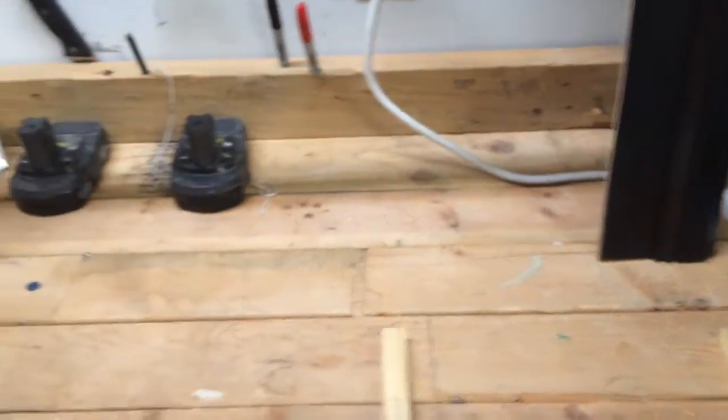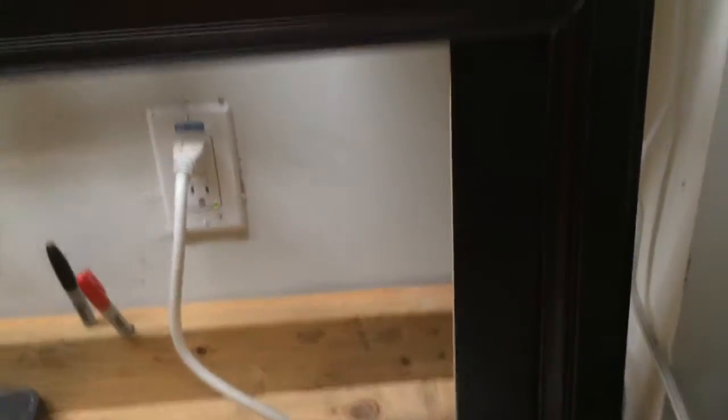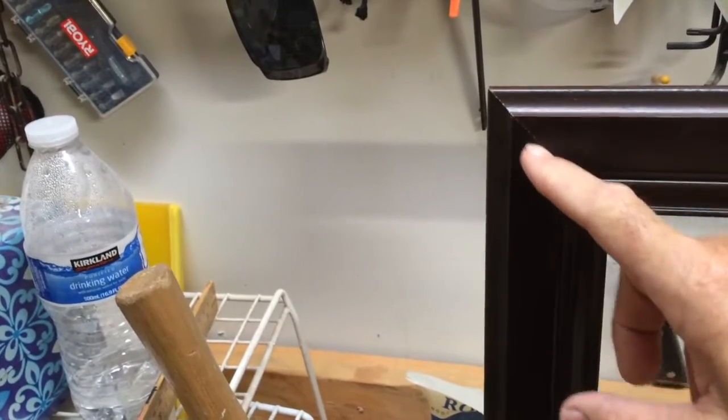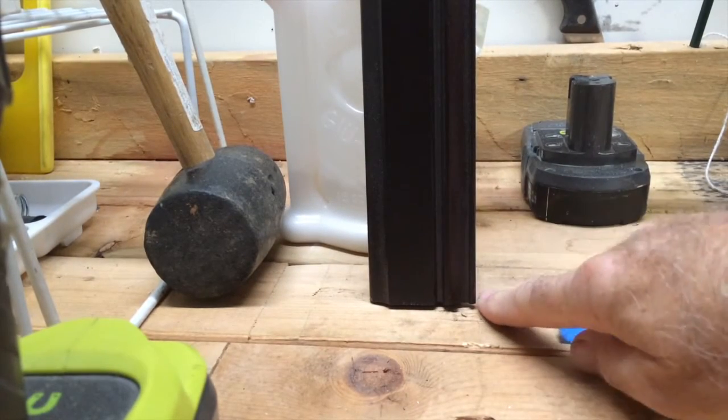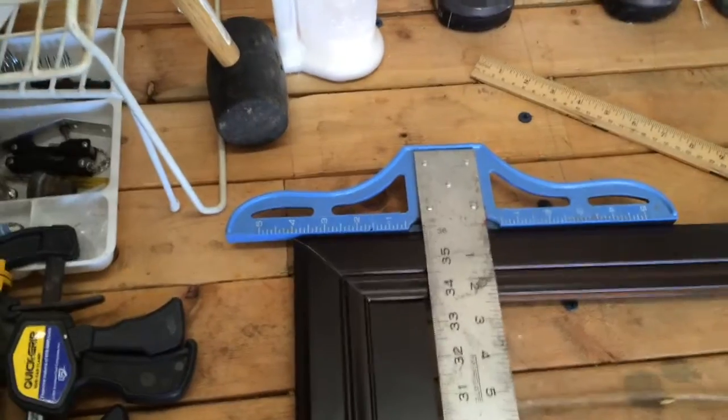What we have here is a frame that goes on the outside with the bottom part, and we'll have the grill plate across it. We went over to a friend's to have our frame corners cut. This one, for some reason, is slanted a touch more to the inside, so the bottom part is going to be narrower than the top part. Here's my test of whether this is square: I have my T across the top of my frame. Down at the bottom it's flush with the ruler, but as you go up, a gap starts to occur — just about an eighth of an inch gap right in here.